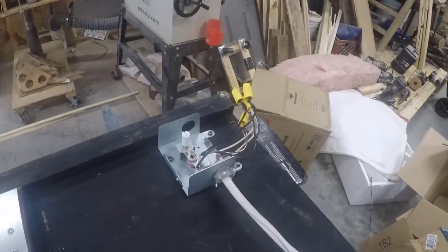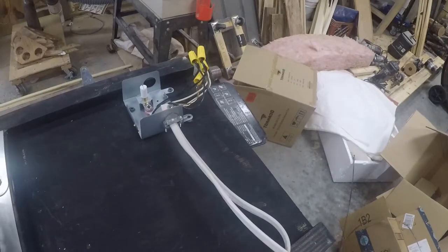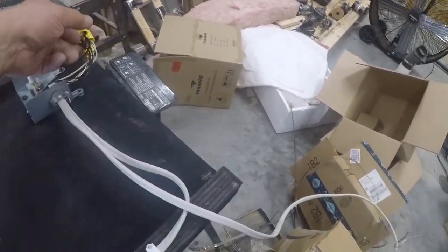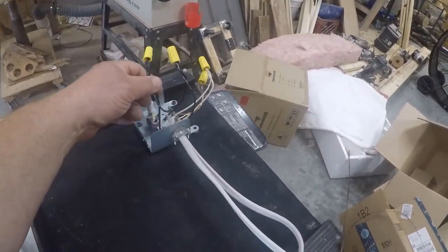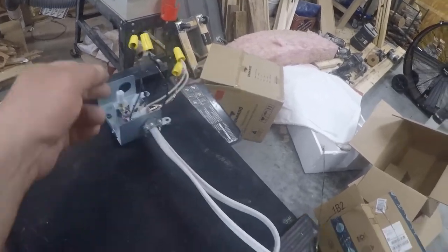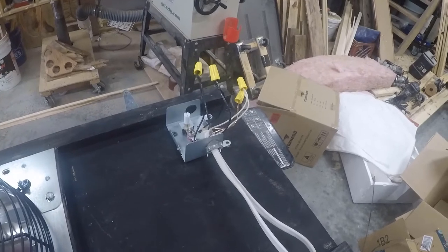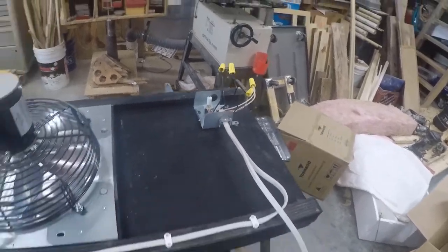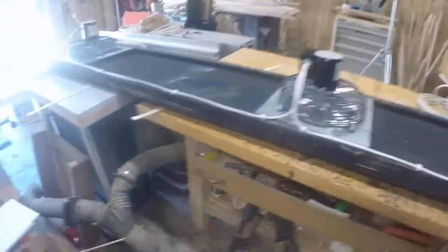Here's my thermostat. The wire will come in. This is just a test piece. Permanent wire will come in, make up, neutral rides on through. Your ground obviously is there and bonded to the thermostat itself. And then there's just a simple two-wire connection on the hot, in and out. And that's about it. Let me button it up and then we can get it hung.